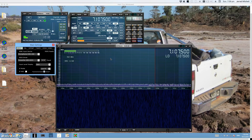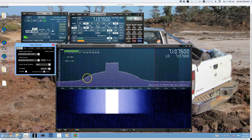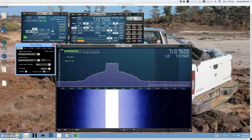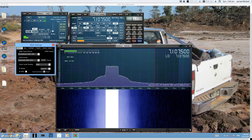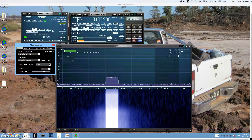I'll show you one more test — the white noise test. It doesn't sound pretty, but it's more indicative of real-world performance, just like my other examples. You can see tones everywhere and the distortion products. And for interest's sake, a slow power sweep: 75 watts, 50 watts, 25 watts, 10 watts, and 0%. At 0% you can see it's very, very clean.